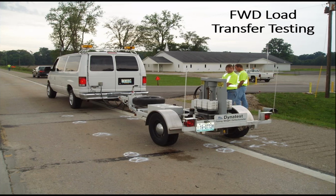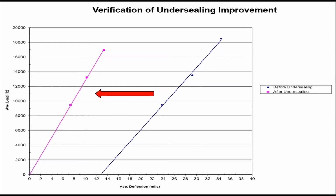virtually none for decades. However, again, with the older jointed reinforced concrete pavements, you would tend to have mid-panel cracks, and you wouldn't have any reinforcement across there other than the mesh, which wasn't doing anything. You would have a loss of load transfer there. So that's where using an FWD or something to check load transfer is handy as far as establishing quantities.